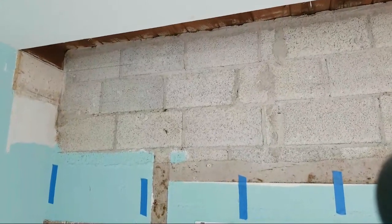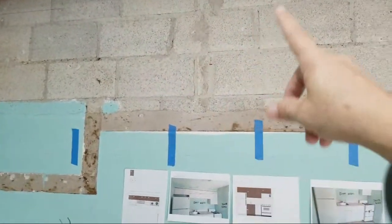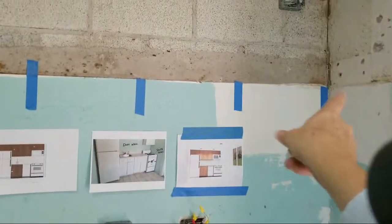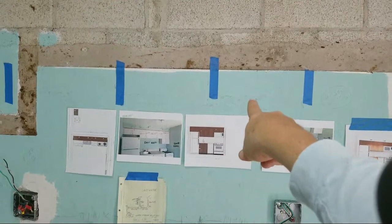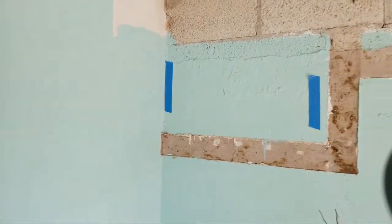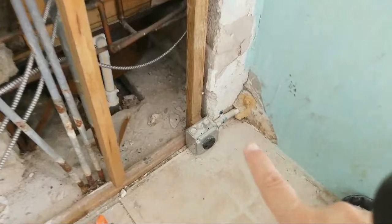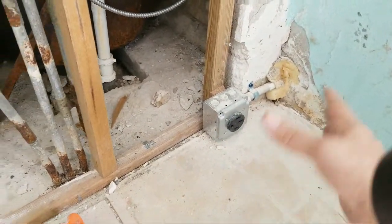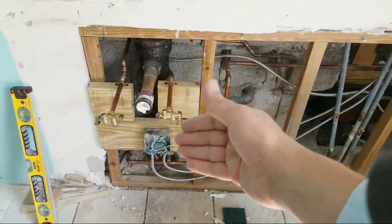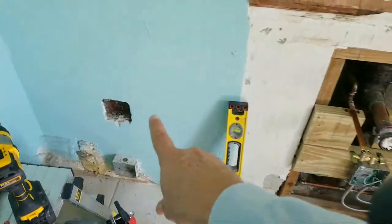That block wall sure makes things tricky, but once we get all of those wood studs anchored in here, everything's going to be great — because then all we have to do is measure and cut drywall. There'll be one sheet covering up to here, the next sheet covers further along, and then a sliver of a sheet at the end. Three sheets will easily cover this whole wall. Remember the drywall is going to come out to about the front face of these electrical boxes, so we'll put extender boxes to get them out flush.